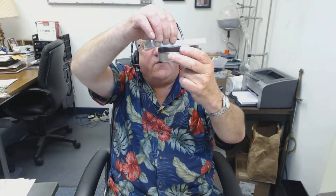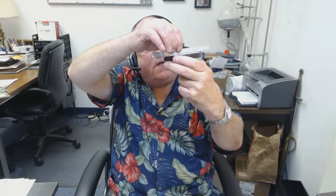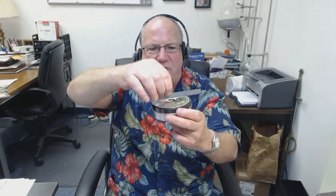What you look for is where light comes in underneath the straight edge. You want to check it across this way, and then you want to check it around this way as well. We're using something round because we're talking particularly about brazing tables or saw blades — but that's the way you check for flatness.